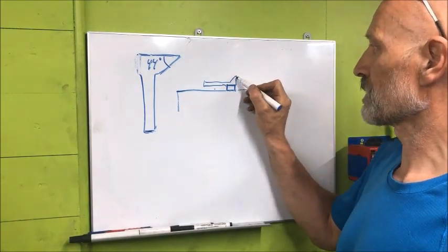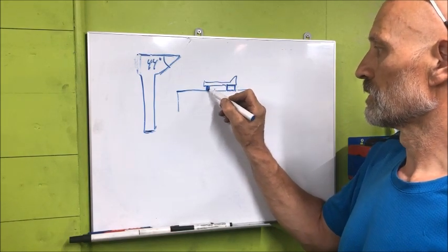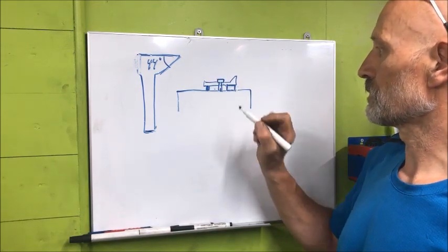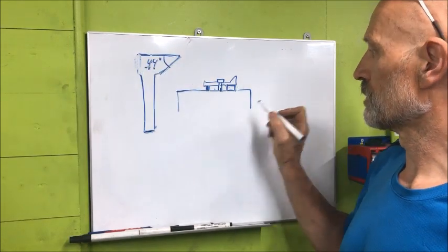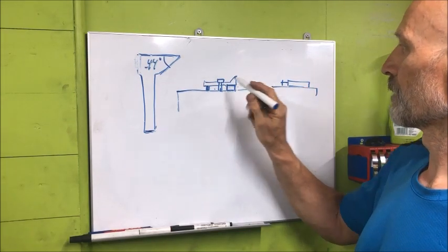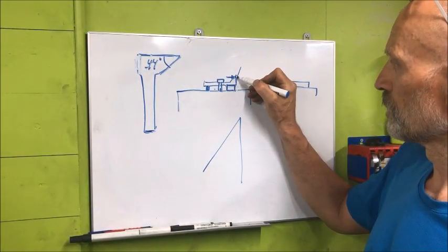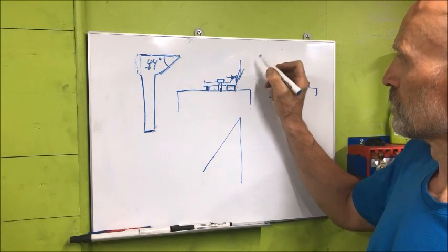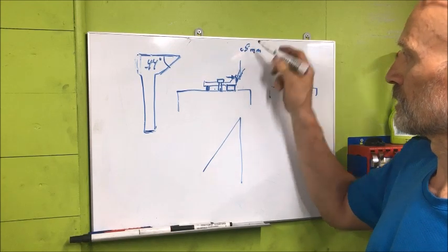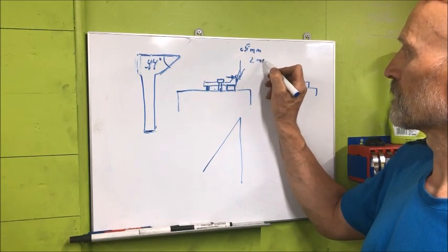Maybe, just maybe, there was deflection because of that, but not much. We blocked it up with a steel beam in that direction, and of course then clamped it down. And if you view the planer from the casting here, we had a stop at the end, so a stop in here. We applied a tool down here, going down, so we went down 0.5 millimeter a step down feed, and we had a cut depth of 2 millimeters.